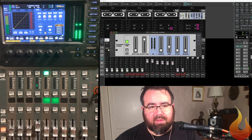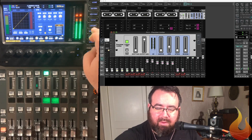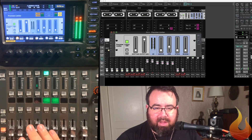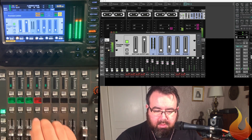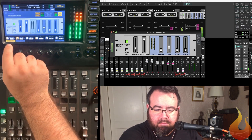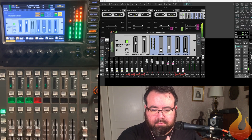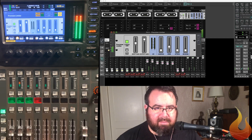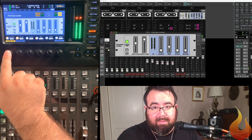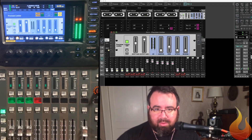I would suggest you look at your gain structure — I've got tons of videos on that and I'll happily answer any YouTube questions you have. So let's go back to our Effects. Remember, before we had to go to 16.5 to get to that level. Let's see what we can do now. I'm slamming that limiter pretty well, and I've only gone up to 11 dB, but really it's like 17 dB because we have that 6 dB from the compressor makeup gain. So that's how you set that up.